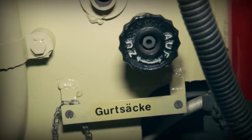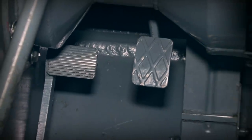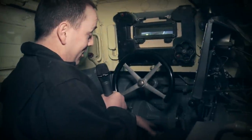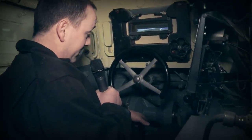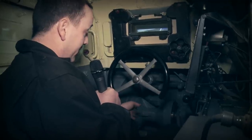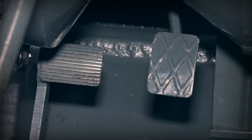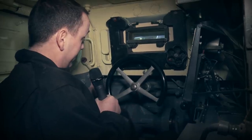Other controls are: to my right, your choke lever. The majority of the time we do give it a bit of choke, and also when you go to start the tank — I'll show you later — in the fire compartment there is a primer unit for fuel. In the driver's area, you've got the pedals down here, very close together, almost like a Formula 1 car. It's so tight that if you've got big boots on it's quite awkward to drive. You've got the accelerator pedal, brake, clutch, just like on a car. Running right in front of you, you've got the output shafts, the drive shafts on the gearbox, through the steering assembly, braking assembly, out to the final drives.